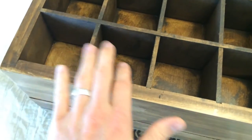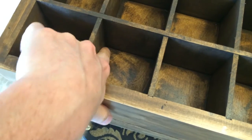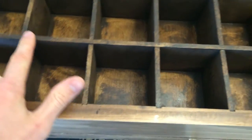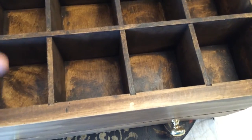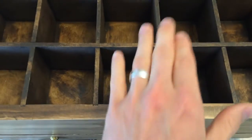If you've done anything with compartments like this, on the inside this is cut halfway through on the bottom piece, and on the cross piece halfway through on the top. Then those two pieces notch together, and it's that way all the way across. So there's a notch cut out of the top of the cross piece here, and on the pieces running perpendicular, the notch is cut on the bottom. That's how you get one piece running across the top and the other on the bottom.